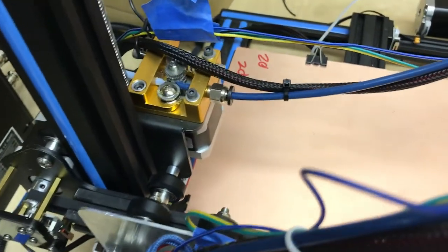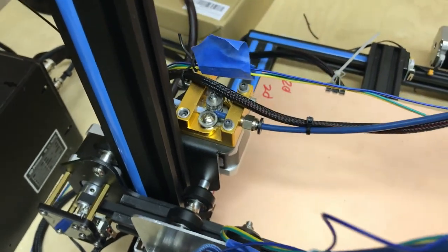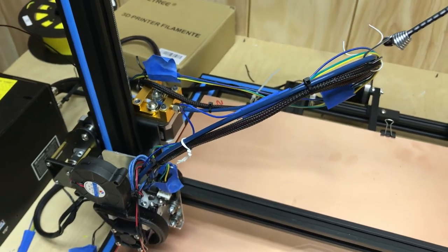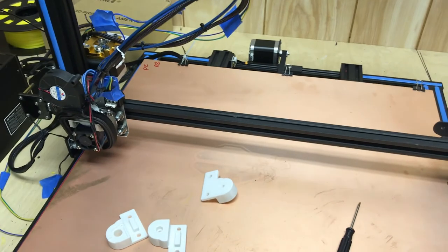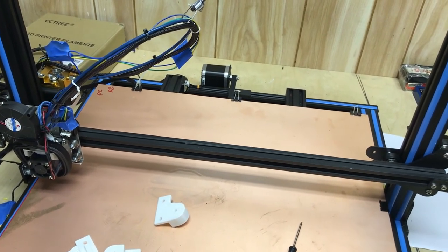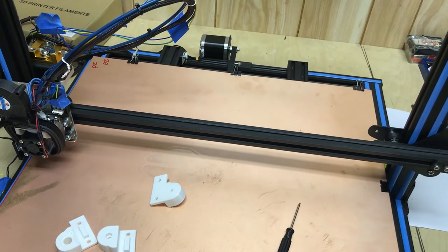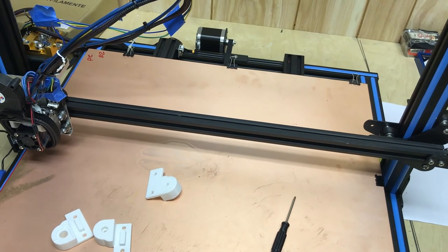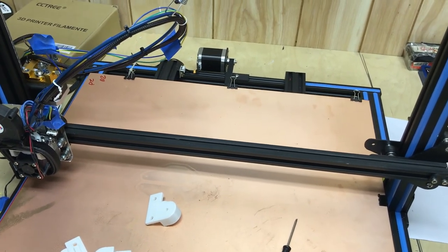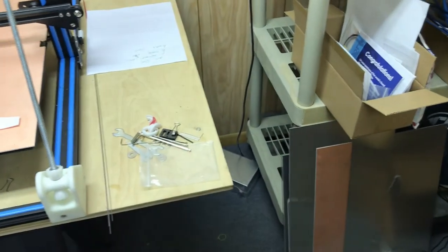There's also an upgraded extruder on here. Make sure you get the fine-toothed gear, and because the gear is a little bigger in diameter, you'll need to go in and set your steps — about a 9-10% difference in steps per millimeter. That's pretty much it. This video turned out a little longer than I wanted, but I gave you enough information about what's coming up in the rest of this CR-10 video series. Stay tuned for the epilogue, support me by subscribing to my channel, and visit my website. There's an email at technical@[website] that comes directly to me — we love working with people.